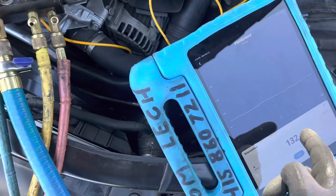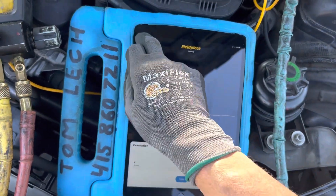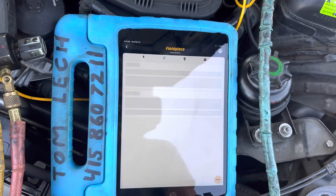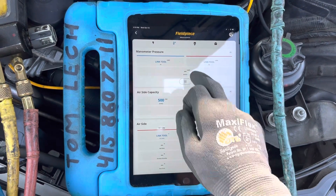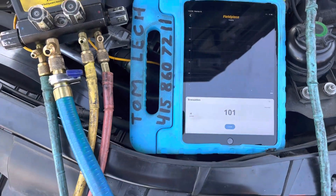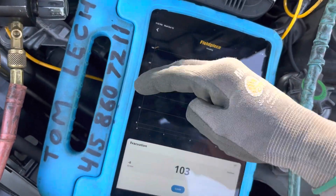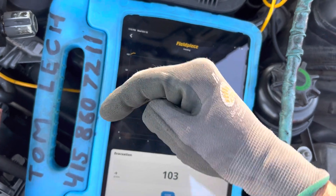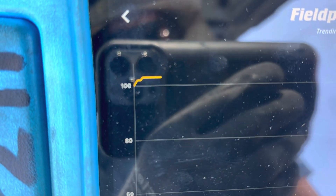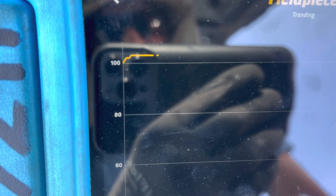Let's re-establish our connection — go back, erase this, re-establish connection, go back into the micron range, go back into the data logging. You can see the graph has expanded into a smaller range, so you can actually see more fine detail because we're down into lower numbers. Right down there you can see 100 microns, and you can see how level and even this is.